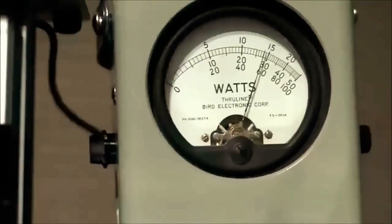Okay, well that was very interesting. 500 watts from the Elecraft amplifier indicated SSB signal was about 10% greater on all the watt meters, at about 560 watts. Which means that if you tune up a tubed amplifier for, let's say, key down at 1,000 watts, you better increase the loading control a bit, because you're going to have peak excursions greater than the 1,000 watts, likely closer to 1,100 or 1,200 watts.